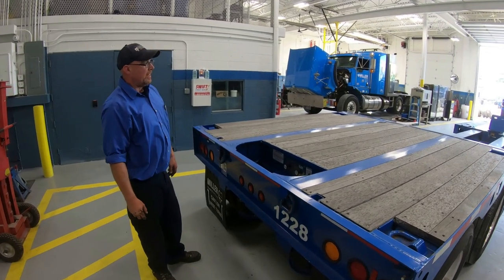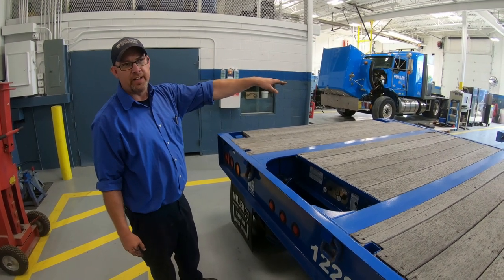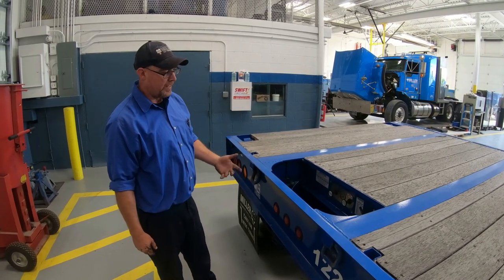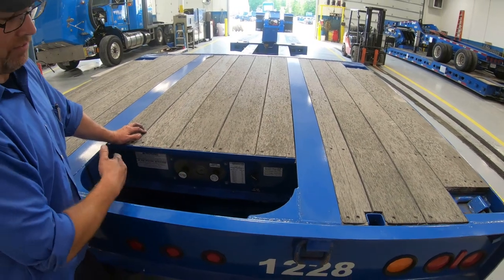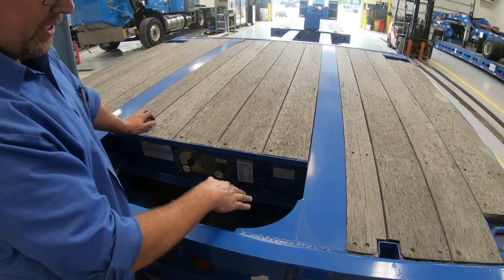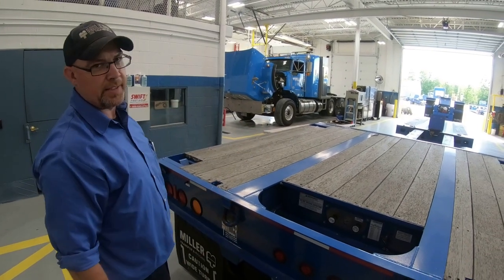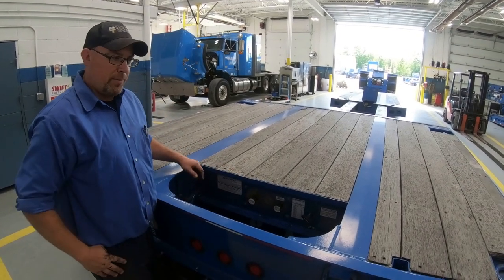The last part here is the suspension. In addition to having the front gooseneck able to adjust the height — especially if you are stretched out and you have a railroad track or another high crown — you can raise the rear suspension. Right here is a cable for the adjustable ride height. This runs off the leveling valve. For normal operating, you push it all the way in for the lowest position, and pull it all the way out to raise. If you're going to go down the road like that, you just need to make sure you compensate your load for that height.